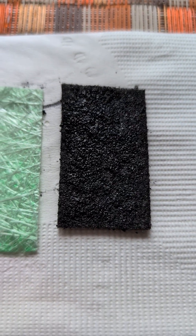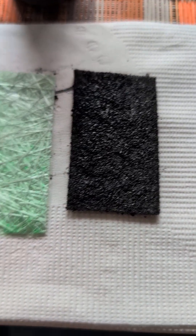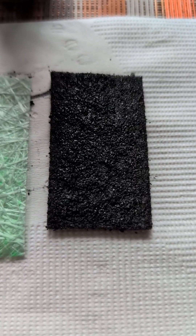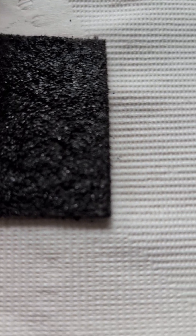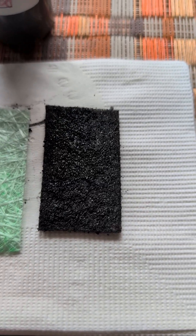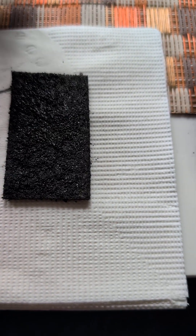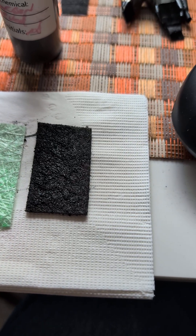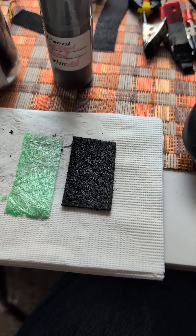On the right you see a section of commercial graphite felt, and that will serve — along with its partner — as the electrodes in the supercap. We've coated this section of graphite felt with a slurry of the consistency of sour cream: fine activated carbon which has been sieved, and a small amount of carbon black G to boost conductivity.